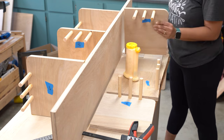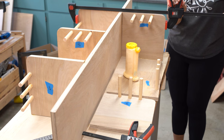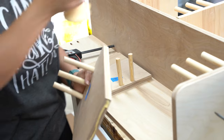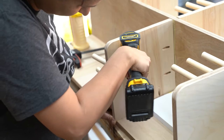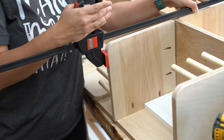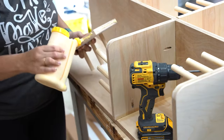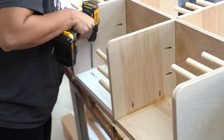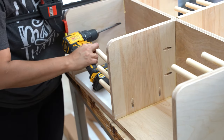Next, it was time to attach on the other side of that divider. And attaching here, you want to be really, really careful about not just the spacing, but essentially you want to make sure that it is exactly aligned with the shelves that we had attached on the other side. And of course, this entire time we have to keep track of the orientation of the shelves, and I am so thankful that I had decided to number and name them, because that made this entire process so much easier and I didn't have to think. I could just pick up the right numbered shelf and attach it.